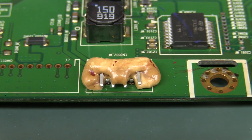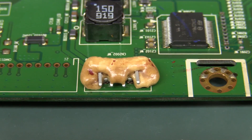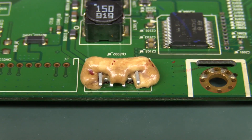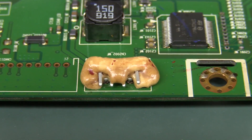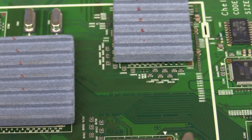So the moral of the story: just be careful using these cheap do-it-yourself thermal ovens. They're not that great, not that precise or controlled. In this case I was probably a bit gung-ho - I'd just reflowed the T-Con board and it survived fine and dandy, so I just whacked this one in without giving it a second thought. This board was almost certainly soldered using a two-step process: SMD reflow for 95% of the stuff, then a dip or wave soldering process for these connectors on the edge.